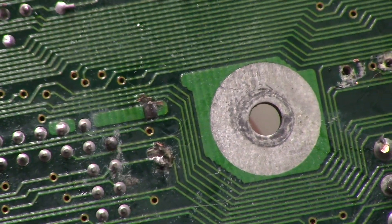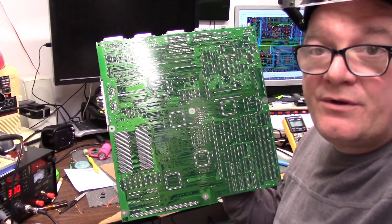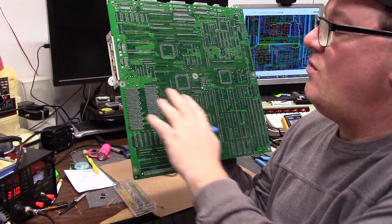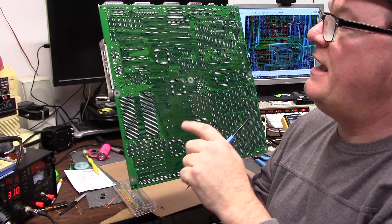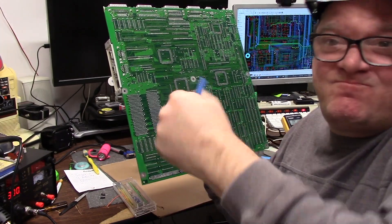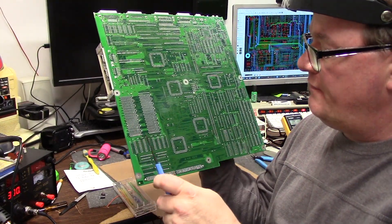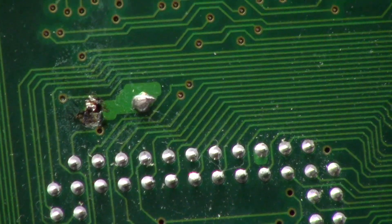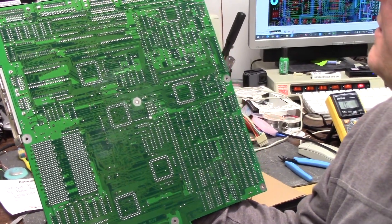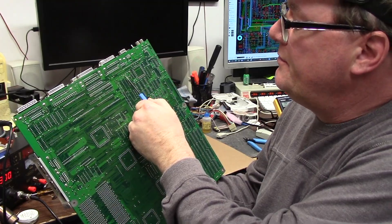So what appeared to be a simple recap — it was working before you touched it kind of thing — now I'm cleaning up someone else's work. This is all over the place, the whole board everywhere. There's a cap — they went in with a solder sucker or something and just ground out the pads and blew all the vias. Here is Ramsey down below — that just looks beautiful — and that's only the half of it. We haven't even gotten to the Amber chip. VCC buses exposed, they busted through.